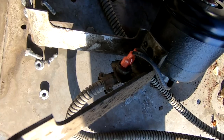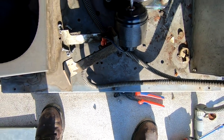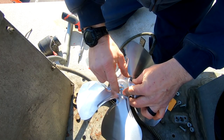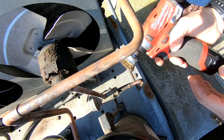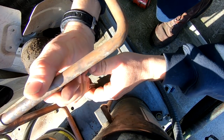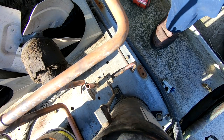That's one way to do it - just chop it off right at the connector there. I'm going to go ahead and clean this thing up. I'm going to unbraze what I can unbraze, like this one right here should just have to do that one right there. We'll unbraze this one, unbraze that one, pull it out, and then we'll just make a nipple for that one right there.